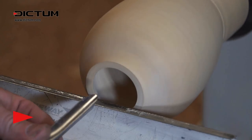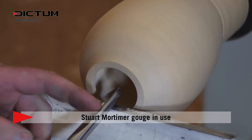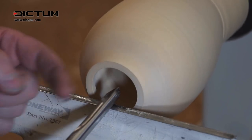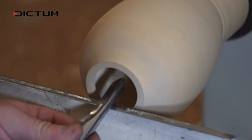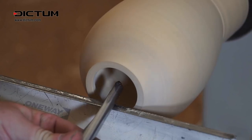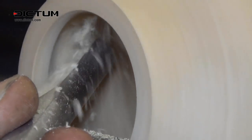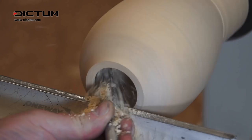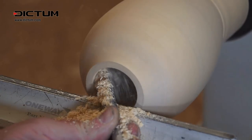Working on this vessel, one advantage of the Stuart Mortimer gouge is the fact that it helps exit shavings up the flute and out of the vessel, preventing so much blockage. I'm going to go in safely with the tool over on its side at nine o'clock, then pick the cut up. As you can see, the shavings are coming mostly back out of the vessel.